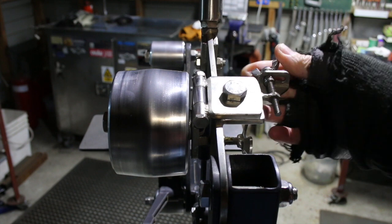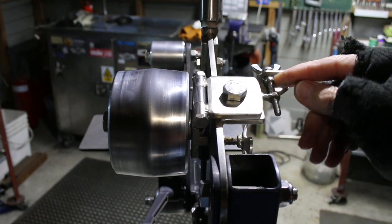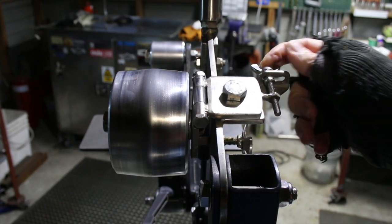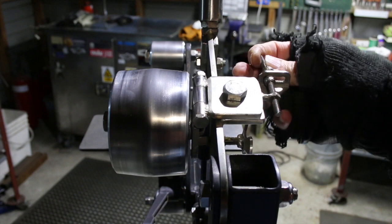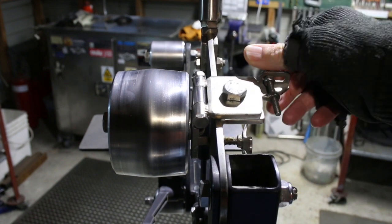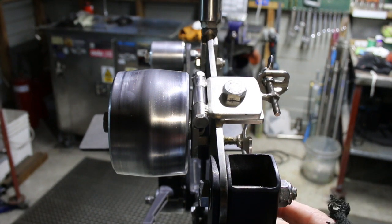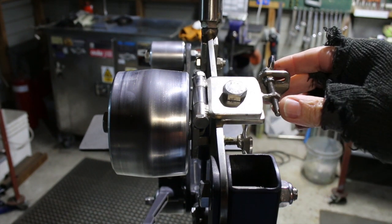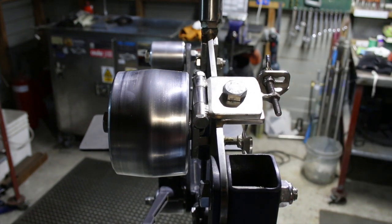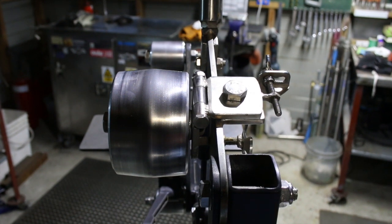It's a very slight amount of turning you need — that's all I use for tracking. That there, I've just welded a nut on there, put a bolt for it, and made up this little bracket here, so there's a nylock on the end of that and a butterfly nut welded to that. It's actually a very small adjustment there. I'll probably show that at the end of the video. Quite often you'll see me reaching up when I'm doing bevels or grinding rough shapes — you'll see me reach up and just tweak it to get the belt off the edge of the platen. This is all I use. So from here I think we'll go over to the bench and have a look at the parts — we'll take one to bits and get a bit of a run-through.